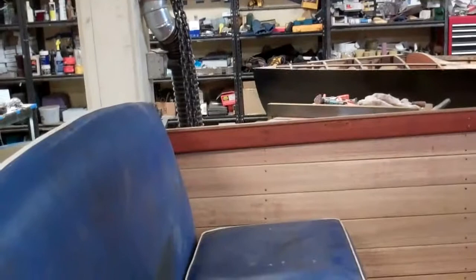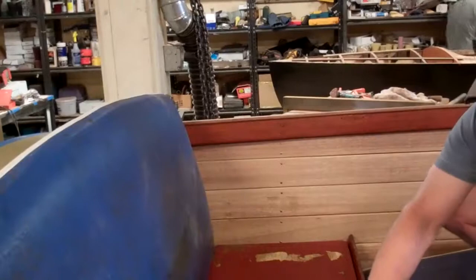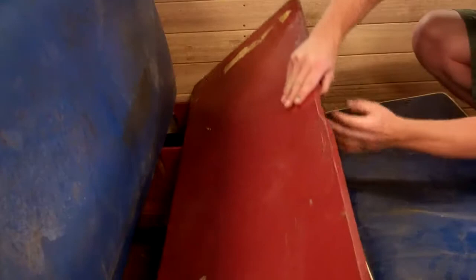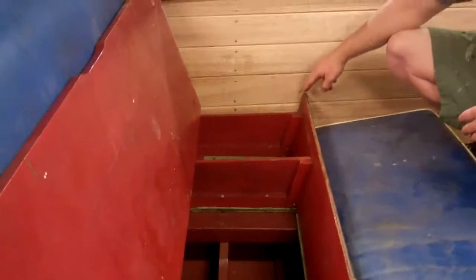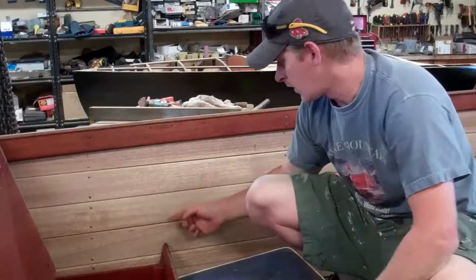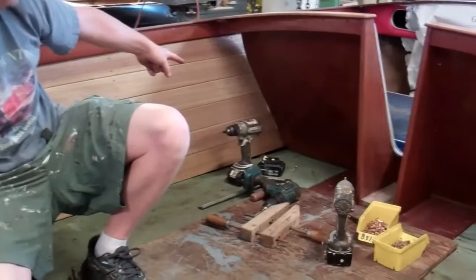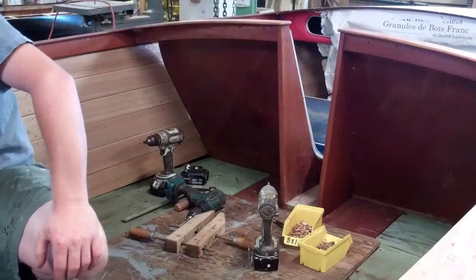The seats are sitting in place because once we put the ceilings on, the interior is narrower by almost half an inch. So John and RJ had to adjust the seat base. On these particular seat bottoms, they actually ran past the frames and went right up to the edge of the boat, so they were about three inches too wide on each side. They had a little notch at this distance where a trim board set into the seat base, and it ran up into those seat bases up front, so we cut that off right at that notch and they fit right in.